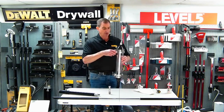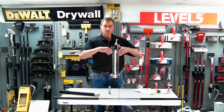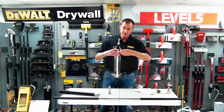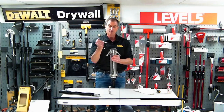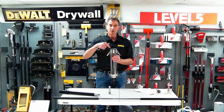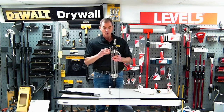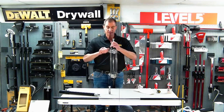From a cleaning standpoint, we have three latches on the top of this. Competitive models have two latches, which creates uneven pressure on that cone. We've gone ahead and built this to be far more robust than what else is out in the marketplace today. The way you pop that cone off is you pull it off at an angle, and then you're able to get in there and clean all the material out. To put it back together, you do that at the same angle, rotate it back on, put your latches back on top and tighten those down, and then you're back in business.